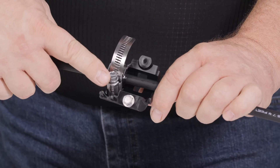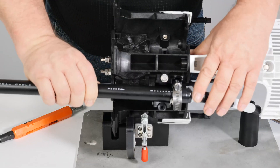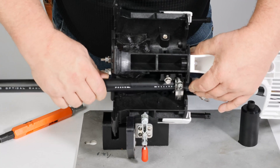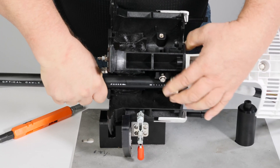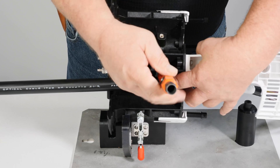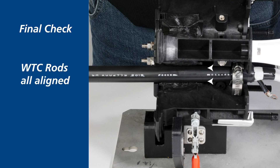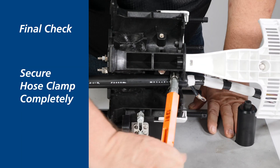Ensure the hose clamp is nested in the cable attachment unit properly prior to installation. Guide the cable attachment unit into the base and route the fiber to the basket opening, being careful that the fiber is not pinched. Lower the cable attachment unit onto the base alignment tab. Ensure it is properly seated with the hose clamp tail retained in proper position, then tighten with a can wrench. Make a final check of alignment of wrapping tube cable rods, ground location, and clearance of sealing wedge, then secure hose clamps completely.